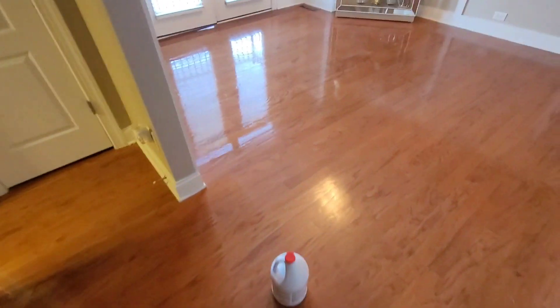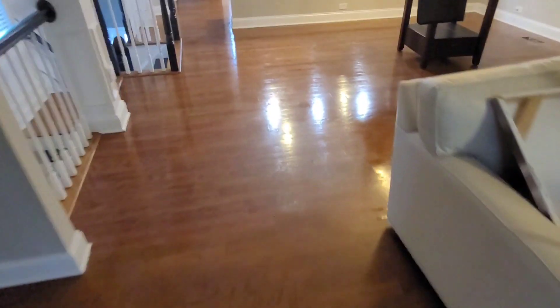We are done with the second location. All the wax has been removed. The original aluminum oxide is still standing good, and we're still going to do one coat of wear layer protection — the floors look really really good. This is the engineered floor. Right now I'm just letting it dry, letting the water and cleaner evaporate off the floor since we did some post-cleaning. Probably in the next 10 minutes we're going to put a coat down and that will do it.